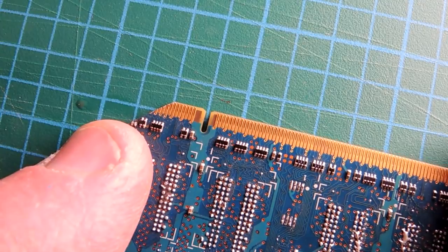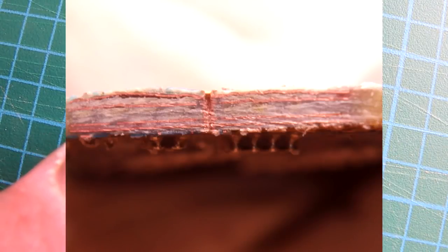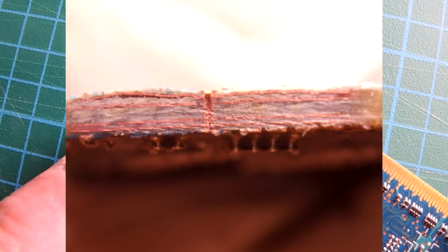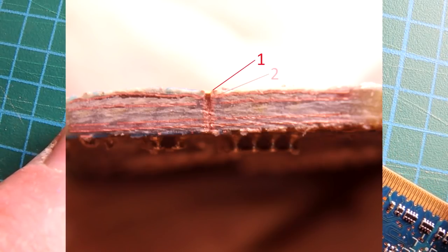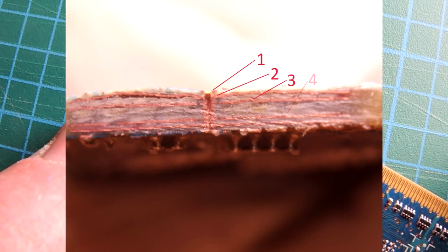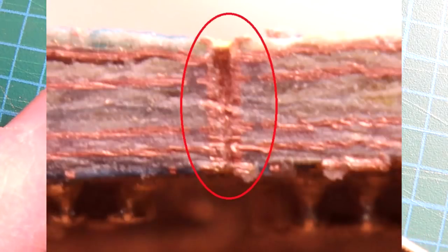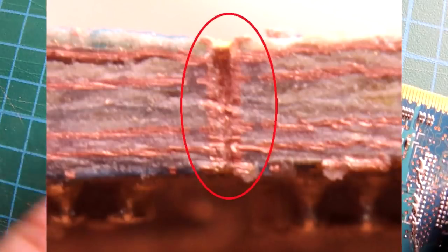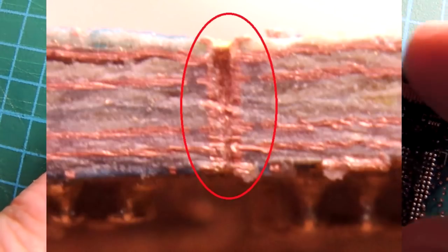Here I've got a corner taken out of the DIMM. I've lapped it very flat, and what we can see is a six-layer circuit board — two outside layers and then four internal layers. There's a via that runs through the length of the circuit board. This particular board doesn't have any high-density interconnect or so-called micro-vias — it's simply through-hole vias on this assembly.